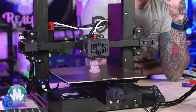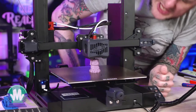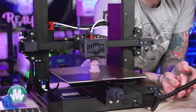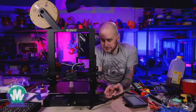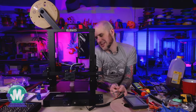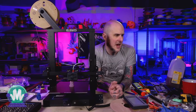Yeah, we could be upwards of 180 on the infill, but we're under extruding on the infill. I think we're under extruding on the perimeter now, too. I don't know, I'm gonna let it go. I mean, for what it is, I'm kind of amazed we're still going. We're at 86%. Definitely gonna be doing some speed tests with my Neptune 3. I'm gonna have to actually play around with pushing this thing more and see what we can do, reliably and repeatedly. But I'm curious now. I like the dual part cooling fan. I think I might like this machine better than I thought I was going to. I really didn't expect to like it.